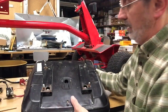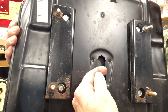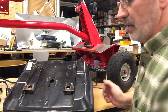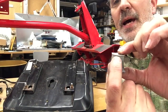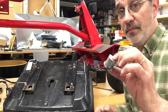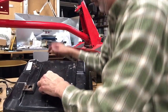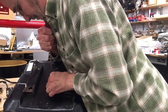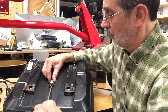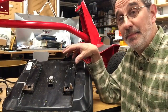These are the little tabs — one sticking out this way and one sticking in this way. You have to get the entire switch pushed down far enough for that tab to slide through above the finger, or it won't fit. It's not easy to get in and out of there. Putting it back in should be a little easier. They probably made it so hard so you'd have to pay someone to switch it out for you.